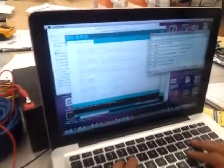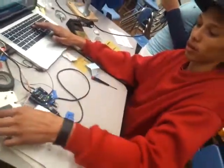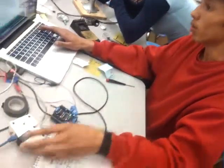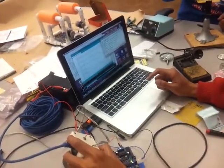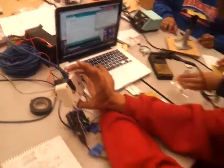The trickiest part of our hack was the up button, which we had connected originally but it wasn't working. The reason it was not working was that even though our Sea Perch is run by computer, we still needed the button on the actual control to be pressed down for the up and down motors to work. If we press U, the motor goes up. If we untape the motor here or press this button, it would break the circuit. To move down we press D and the Sea Perch dives — and again, pressing that button breaks the connection.